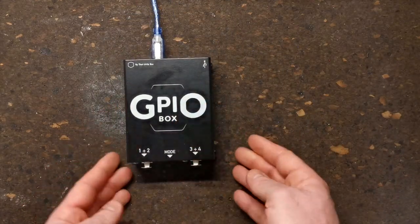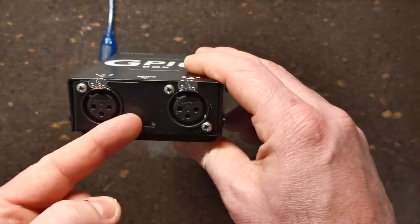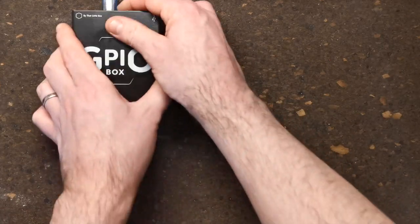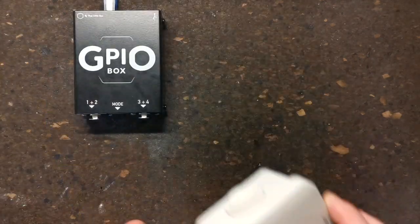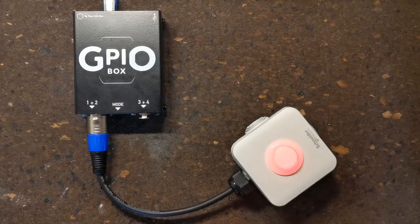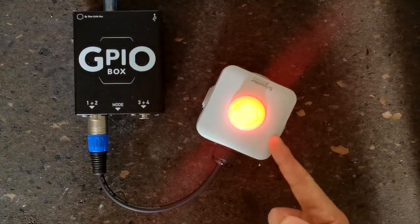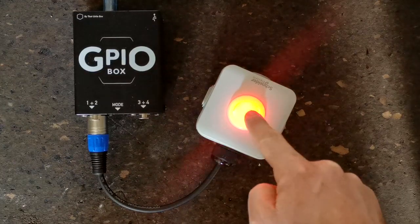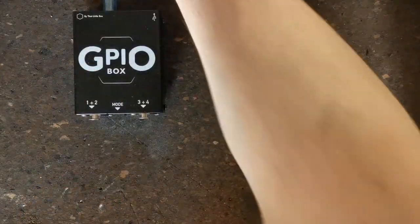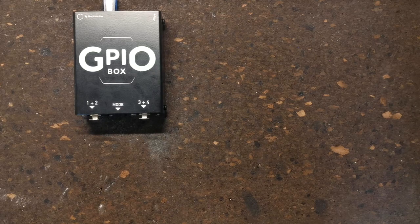Now let's look at two button or illuminated mode. To enter this mode, power up the box with the switch all the way over to the right. In this mode each XLR can be connected to only one button, wired as a switch between pins one and two. Pin three outputs five volts to run an LED. This LED will blink off when a button is pressed to give some visual feedback. You could use a Y-split cable to light an LED separate from the button box, or use two XLRs to feed a box with two illuminated buttons.